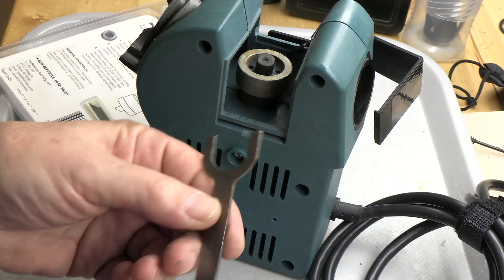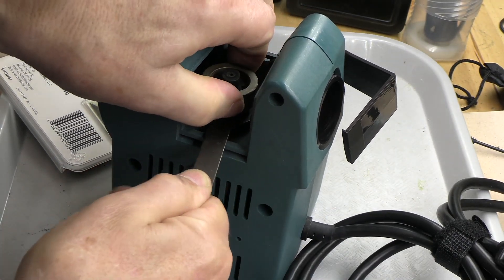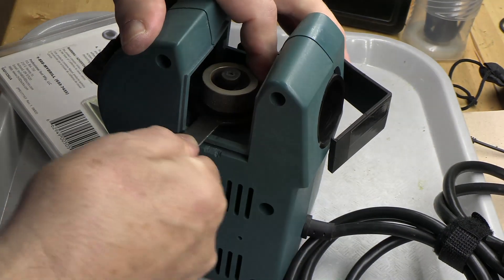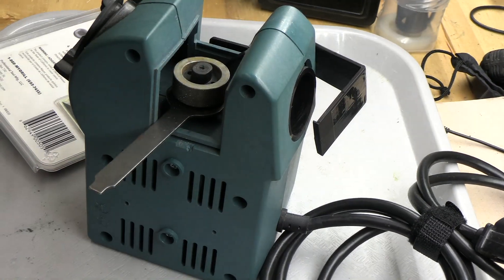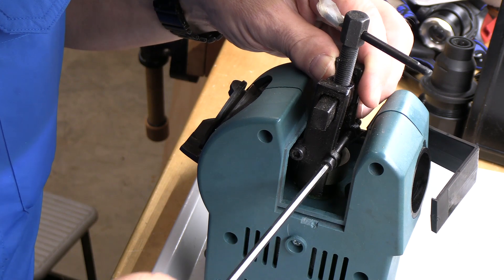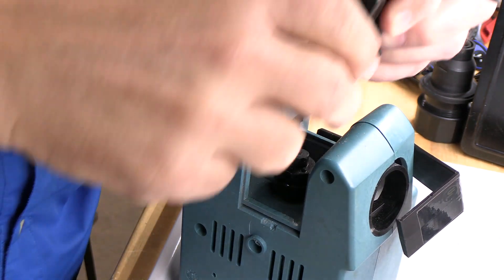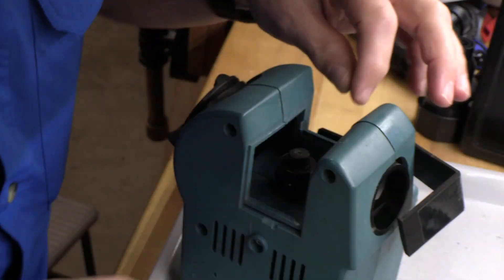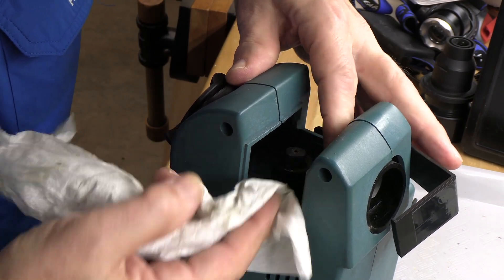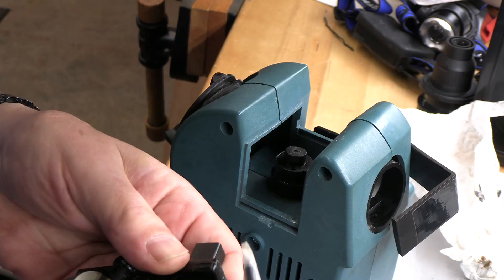This wrench comes with the Drill Doctor and it's used to lock the wheel in place. There are two flats here, and then we can just twist it off. You can see I've had a bit of a challenge, so I've had to put a gear puller on this. I think there's some glue that was used and I'm going to see if I can just pull this off. It wasn't a simple slip-on, slip-off — but there it goes. We pulled it off and it had a brass shim around it. So we got it off; it wasn't quite as easy as you'd think it would be, but then it came off just fine.